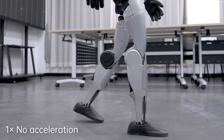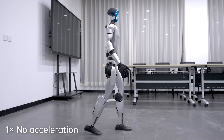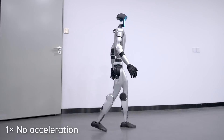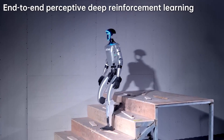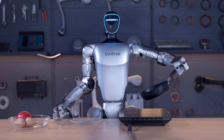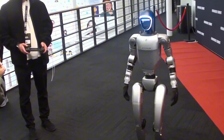When it comes to movement, it has industrial-grade cross-roller bearings in its joints, providing high precision and load capacity. The joints are powered by low-inertia, high-speed internal rotor permanent magnet synchronous motors, which offer better response speed and heat dissipation. The knee joint can deliver a maximum torque of 120 Nm, and the arm can handle a load of up to three kilograms. The robot's legs are about 0.6 meters long and its arm span is around 0.45 meters, giving it a compact yet powerful build.